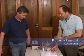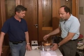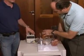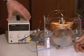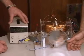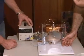This here is a more developed version of the motor. We are using two coils and four pulses to generate the movement, which gives more power and speed. We can see that with only 3 volts and practically less than 6 watts, we are able to start it. Now we will speed it up to see how fast the motor can spin — with only 15 watts at 3000 RPM, or rather less than 6 watts.